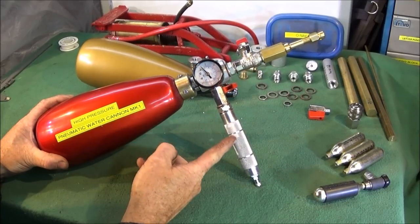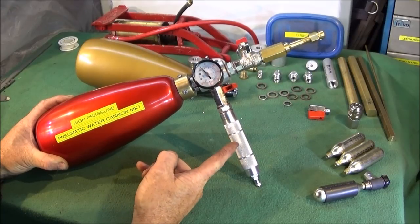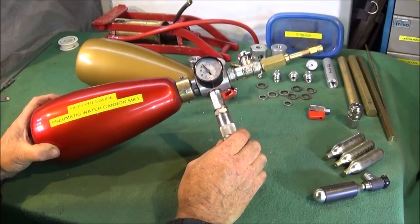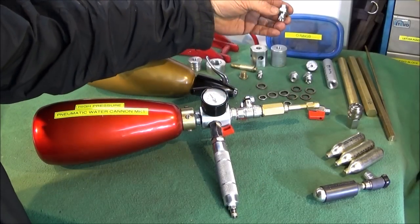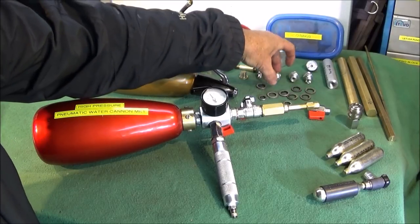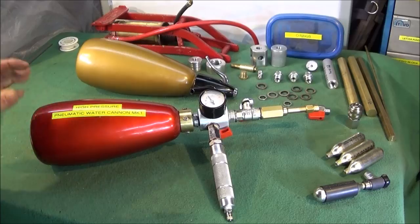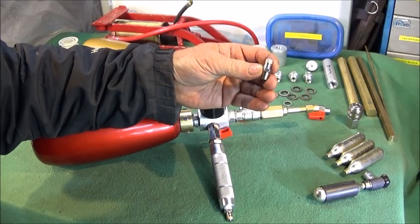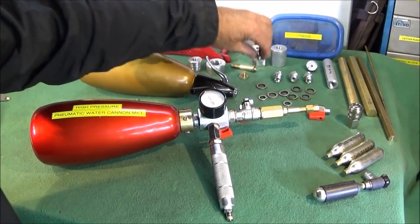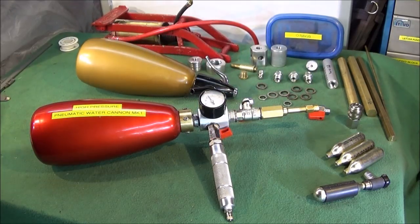Use a good quality aluminium. I use 6082 T6 grade, which is ideal for this project, and check all the hydraulic pneumatic components that they're within the safe limits of whatever air pressure you're using. Like this one here, this Schrader to 1/8 BSP is rated at 500 psi, and I know that all the others are safe for what I'm doing.